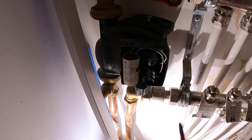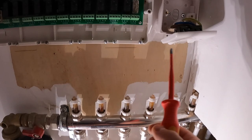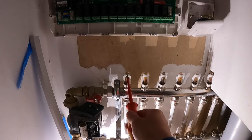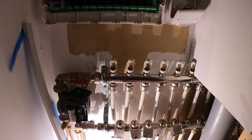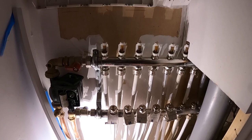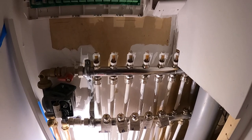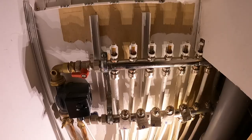The pump flex is too short so we're going to replace it. The new cable runs up into here — the pump feed comes out and runs along the mains, giving us our feed and pump connection. When the thermostat calls for heat it'll open the valve, turn the pump on, pull the hot water through, and send it down the relevant loop. That's essentially what it is — a switch. We need to program them all up and label everything so the next engineer knows what's going on, unlike the boxed-in cupboard I came to with no documentation.